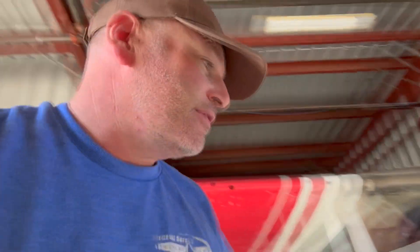There it is, guys. The exhaust is a horrible place to ground your airplane for fueling, for a handful of reasons: it could cost you a lot of money, and it's not even very effective. Find somewhere else on the airframe — install a grounding tab if you have to, use the nose fork, get a meter and check it out yourself. You'll never see me grounding any airplane I fly, own, or operate off the exhaust muffler.